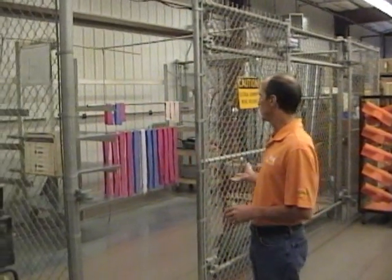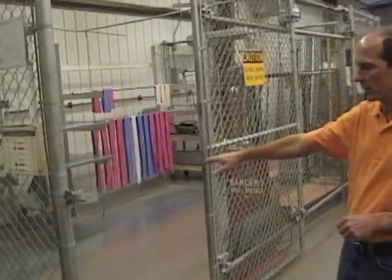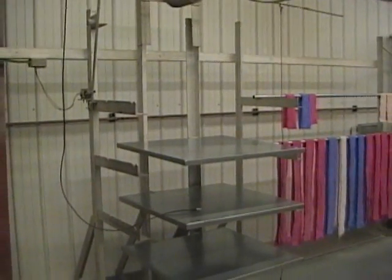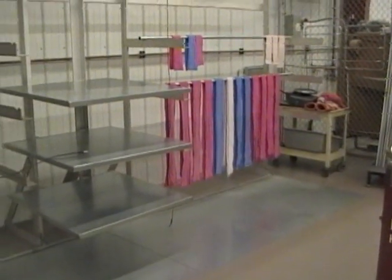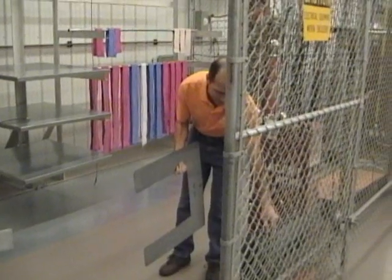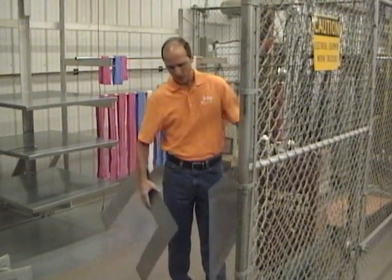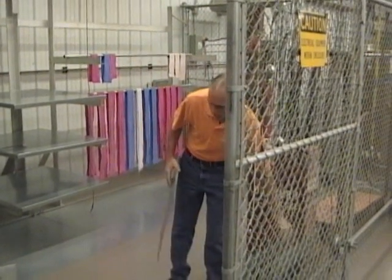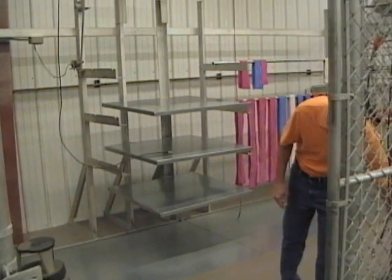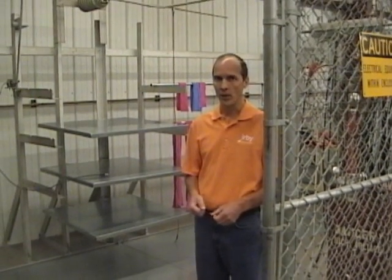After visual inspection, we use this cage setup for testing. We have three trays inside there which we can put blankets on, and we also have steel mats on the floor which are grounded — those are also a testing surface. We use metal plates designed for the different voltage classes of blankets, whether it's a split blanket. This is measured out for a class 4, 40 kV split; this is the size for a 40 kV solid. We lay these on top of the blanket, connect our jumpers to that, apply voltage, and we can test as many as a dozen blankets at one time. We can also test line hose — up to 12 line hose at a time as well.